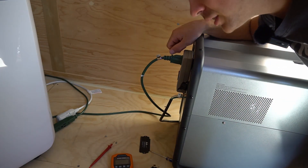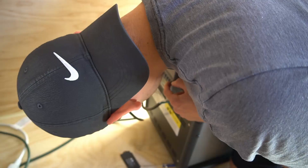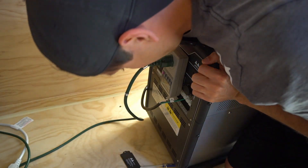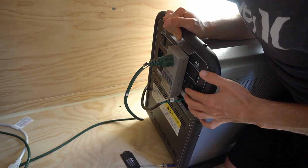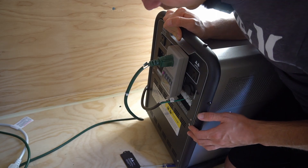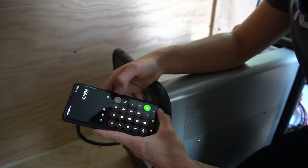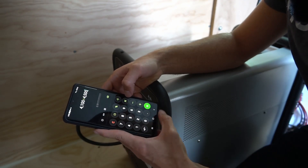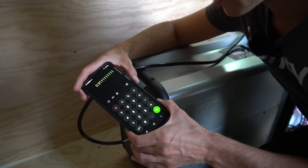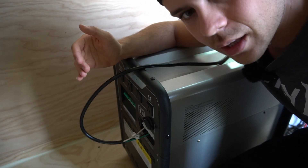This thing's been running all day and I wasn't even here when it disconnected. Let's power it on and see the results — it says 4.1 kilowatt hours! Either the inverter efficiency is really high or this battery is larger than advertised, or maybe it's advertised properly. So 4,100 divided by 4,500 gives us 91%. That is very impressive for a solar generator — usually it's 75 to 85%. I've never seen anything come close to this.